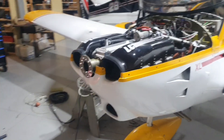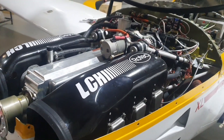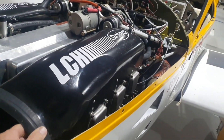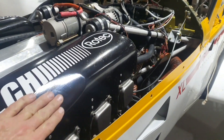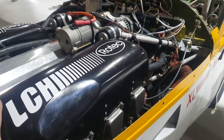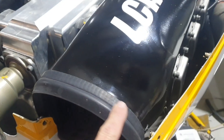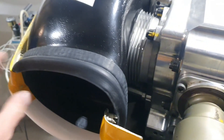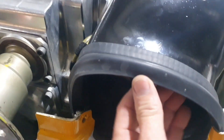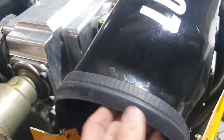We've finally broken the back of this beast, put the propeller on and pushed it outside for a test run — she's all complete. The reconditioned baffles are on, there was an ugly bit of metal that was pop-riveted in there so I've replaced that with fiberglass and filled it in. We've got the LCH decals on and I used this really nice rubber trim — we pulled off the old rubber which was pretty hard and crispy. That's just beautiful — a nice solution for the baffle seal, fits perfectly and allows that little bit of sponge to give plenty of sealing and fill the gap.